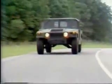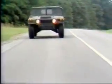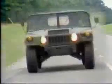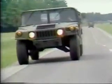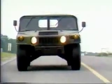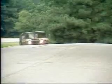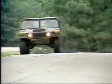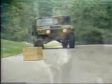First, because of the Humvee's unique shape and low profile, the driver gets the perception that this vehicle is wider than most light trucks. This causes new drivers to run off the right edge of the road. To compensate for this, drive closer to the center line of the roadway. This will prevent you from running off the edge of the road. This vehicle is equipped with four-wheel hydraulic disc brakes, which means it stops much quicker than other light trucks.